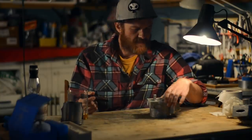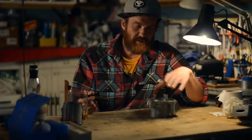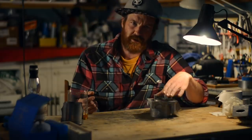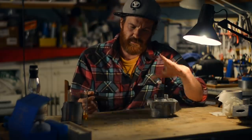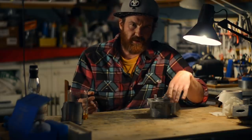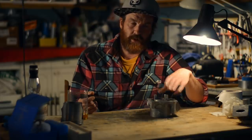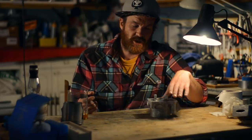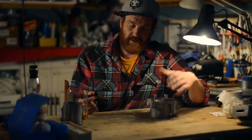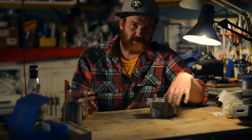It's a success. I measured it to about 90 microns. I would have thought it should be thicker, but it's thick enough. I think I'm a bit conservative on the amperage. I've been running 0.1 amp per square inch, and that's really low. I've been reading up on the amperage needed for plating, and it seems that's kind of conservative.